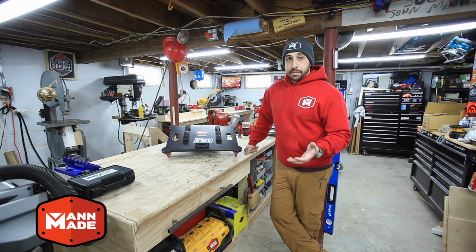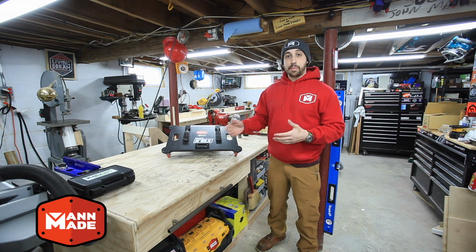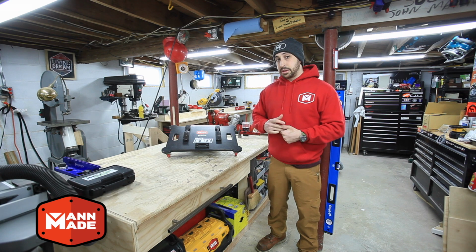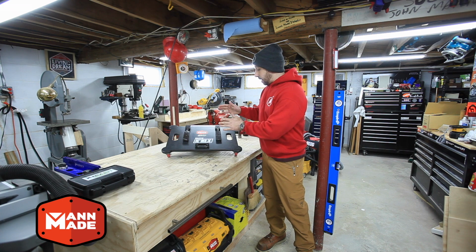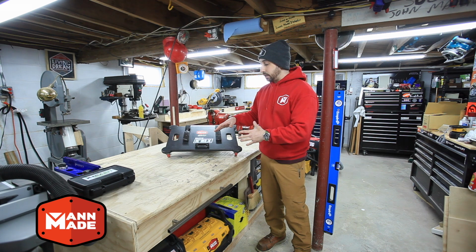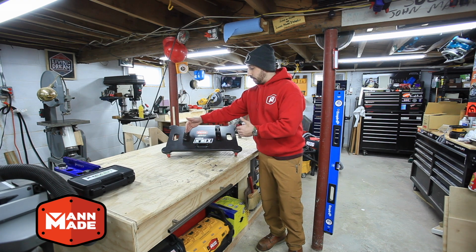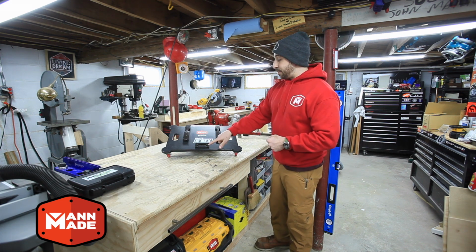It's been a year. It's still not available. So after a couple of years now of Packout being out and not having a solution for that dolly situation, KaizenInserts.com created a product, the Kaizen Connects, that would allow you to mount any Packout box to a surface of your choosing. And that product is 2 HDPE machined feet, which are mounted 10 inches on center. They're pre-drilled, mounted 10 inches on center, and an optional clip.